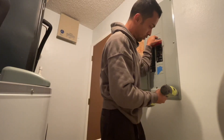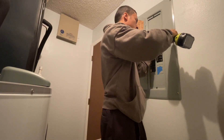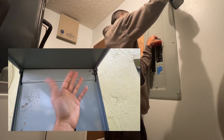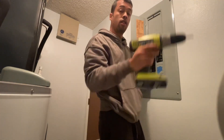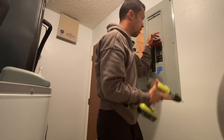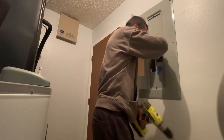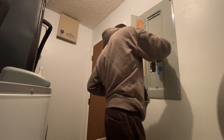This is a sub-panel with six screws installed, and the panel cover doesn't have a slit keeping it up. In instances like this you always want to keep contact with the magnet. The one outside I was able to let go because that cover had something holding it up, but here as I switch to the other side I'm going to hold the drill between my legs while keeping contact with the magnet — because if not, the panel is going to fall as I unscrew the different screws.